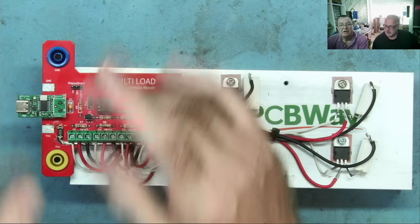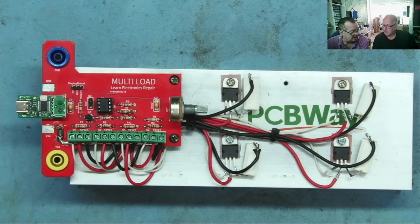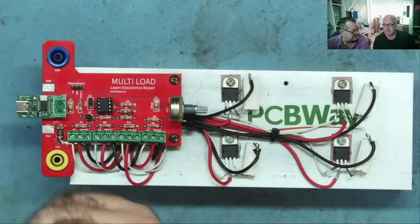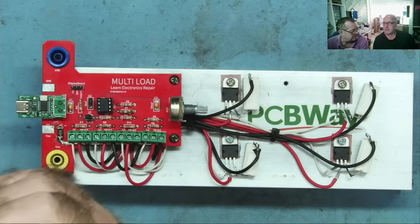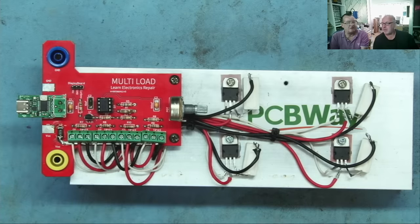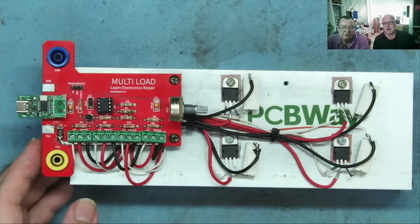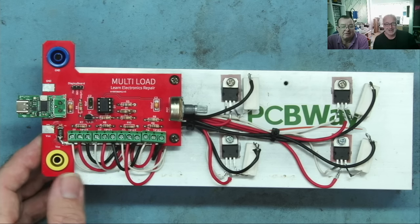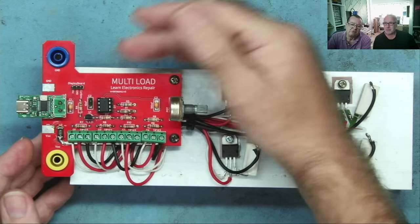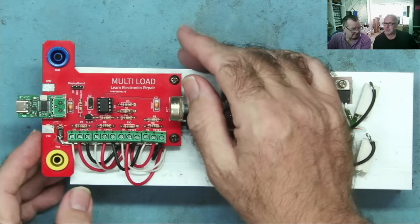I remember. Yeah, so originally we were going to go with a 9-to-1 ratio, and we ended up with about a 29-to-1 ratio. So what Dad's saying is that with a 29-to-1 ratio at the maximum input voltage of 30, we get 1 volt into the ADC. And the reference on the ADC is 1.1. So we can use the full resolution of the ADC. So that's what we did in the end, guys. We'll show you some rather strange resistor values. And so that was one problem. That means we don't get too much voltage from the monitoring to blow up our little chip.